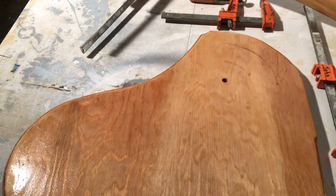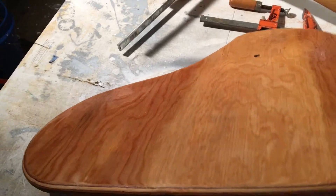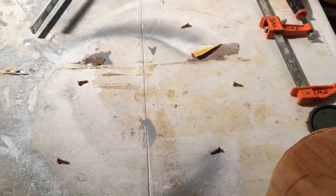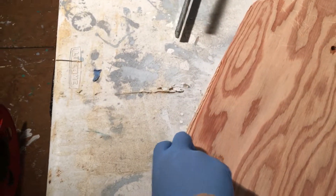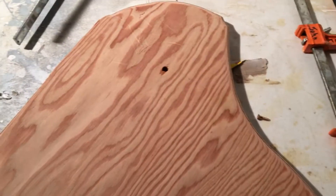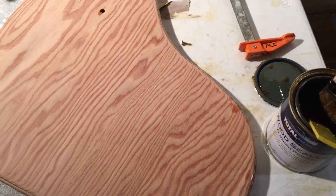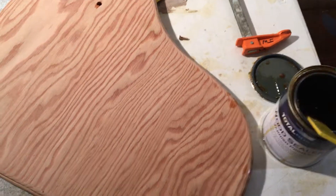We've got one side going. To get it flipped over to the other side, a little trick I saw — I think Louie showed it to us on some of his Total Boat videos — is just throw a few screws down on the table, and when you lay the piece back over it, it's held up off the table. You'll have one little spot where the screw heads are, but you just take your wood sealer.